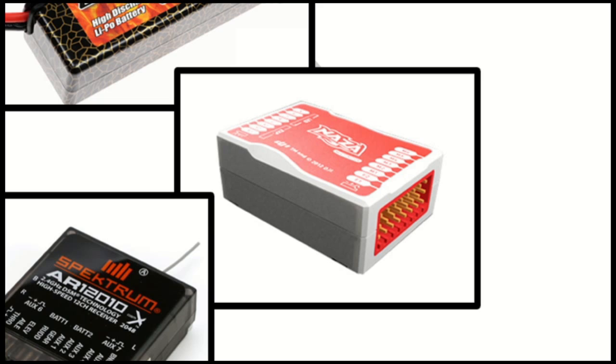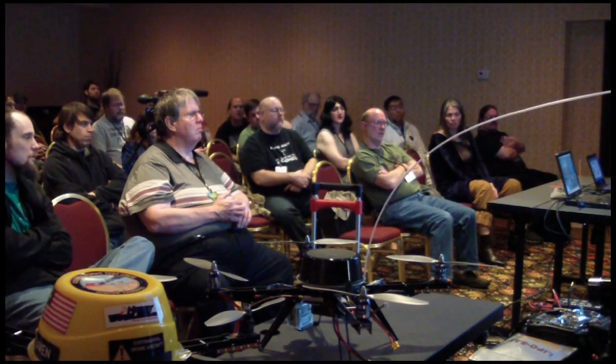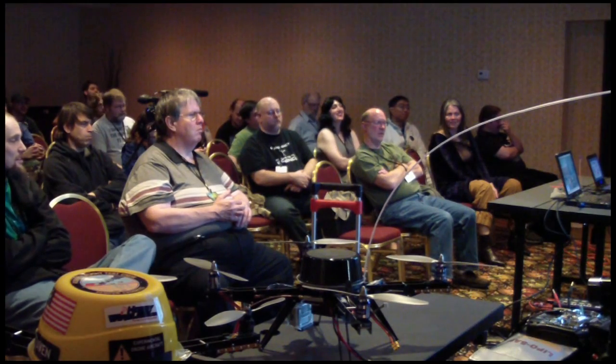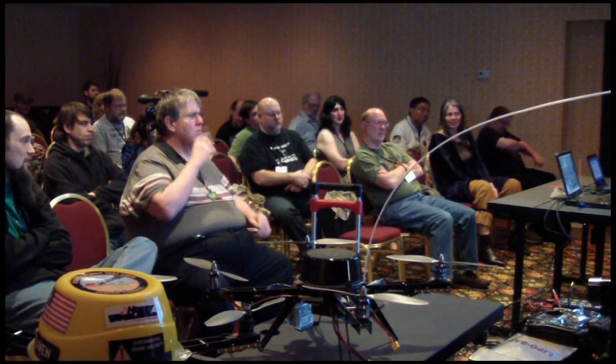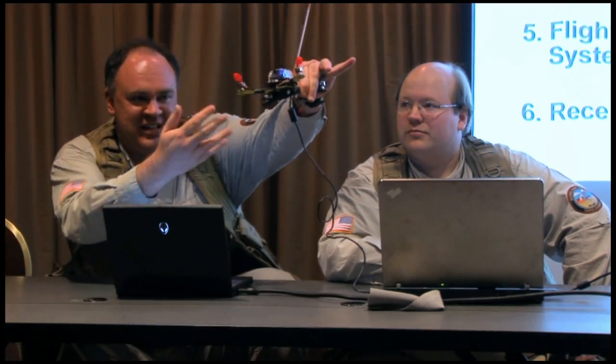Brian already kind of talked to you about the flight control system. That's basically the electronic brain that allows the aircraft to be stable in the air. Yes, sir? If it were to lose a propeller or a motor, would the flight control system automatically adjust for that? It's not programmed to do it. It doesn't go, oh dear, I just lost motor 4. A 4 rotor would just fall, because there isn't enough left to do that.